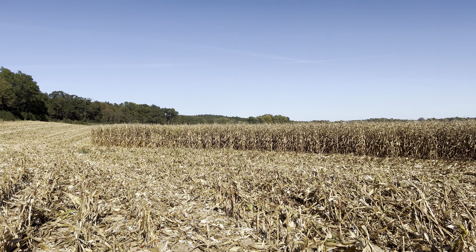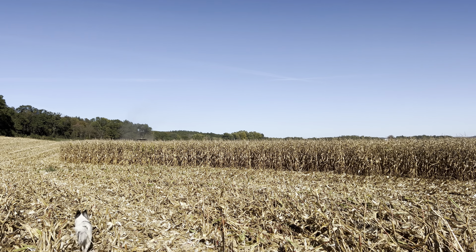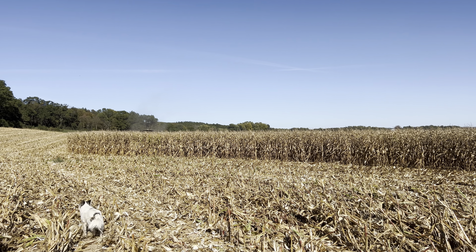What we were doing with the combine before was that the sieve motor wouldn't adjust and it was a blown fuse. We found it and got it going. Mason checked all the fuses, but I checked them again and found the bad one, and then it worked. Like we always say, Greggy's Mr. Fix-It. It takes a little time — there are a lot of fuses to check and you never know which one it is, so you check them all.